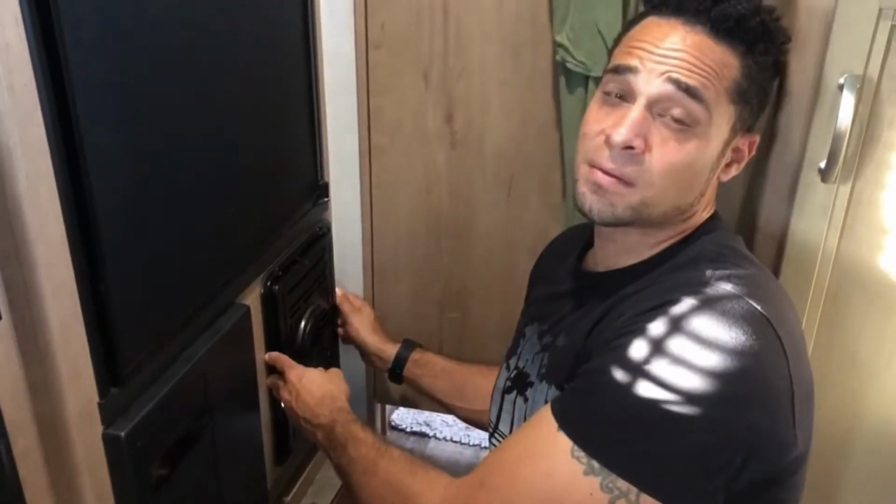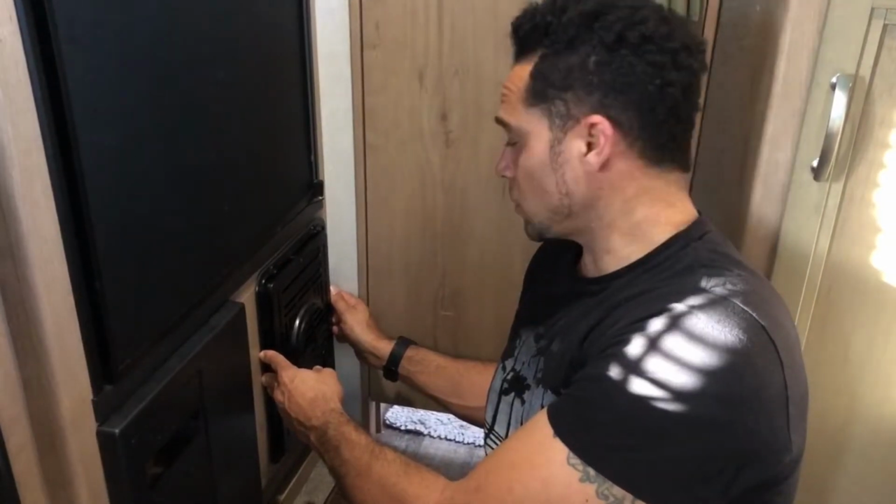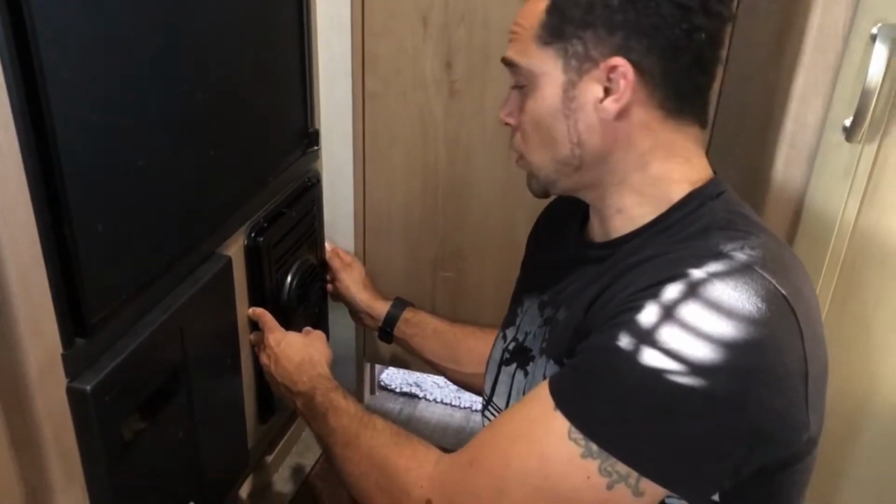If you pick out your manual, you'll see that it indicates that every 3 seconds you'll see one solid blink, that there's an airflow problem, and so we need to fix that. So we need to look at our sail switch. So let's take out our sail switch and take a look and see what's going on. So if you've had a problem with your furnace, then just know that you're going to have to do this.